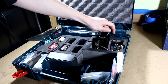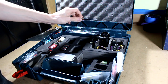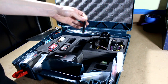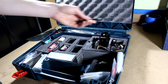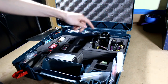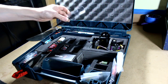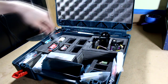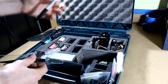Back here I've got my long tools: my brush hood alignment tool, a Trinity spring tool, and a spring post nut wrench. And then I've got some tweezers for getting the little bushings out from the bottom of the motor can, an exacto knife for scraping out between the comm segments after cutting, and a sharpie for marking the comm before you make a cut.